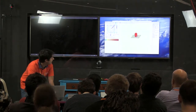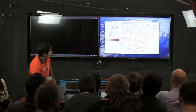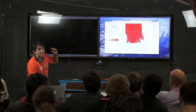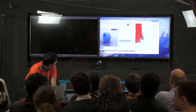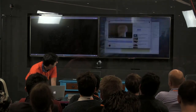And if we zoom in, it's only lines. It's the path the 3D printer is going to make. That's it. And then, finally, you can just use the software. That's the software I'm using to send that. Basically, the software is taking that text file, taking it line by line, and sending it to the 3D printer. The 3D printer is quite dumb. It's not thinking. It's just receiving that line by line and moving the motors as it says. It's quite simple. And after that, that's your final result. Yeah, it's cool.